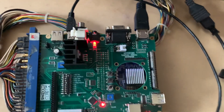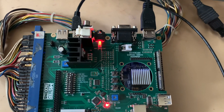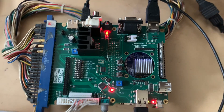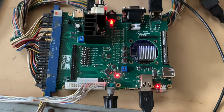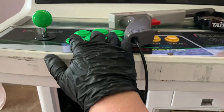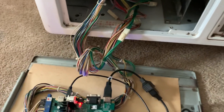This last one is just a USB power connector. I bought a little USB-powered digital audio DAC wireless Bluetooth thing so that you can use Bluetooth headphones, but I haven't quite decided if the latency is good enough for regular use. I have a USB keyboard connected right here because I'm still working on this little encoder circuit for the actual arcade controls. But it will do two-player, six-button, both start, coin, and I think service button also hooked up.